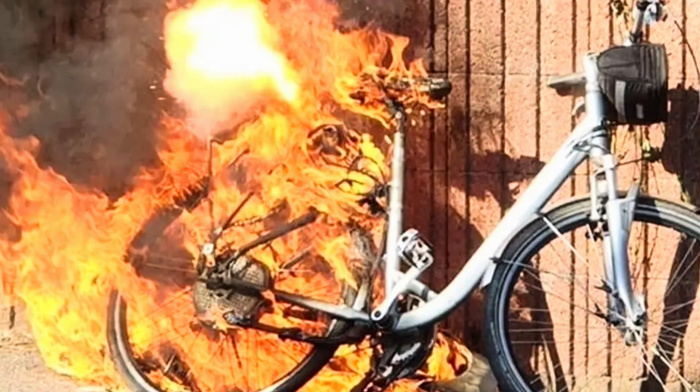Once you go into overcharging on a battery and leave it on overnight, if you haven't got a BMS, this is what starts the actual cascade of thermal runaway. You'll normally know if a battery's about to go off because you'll smell it first — there's a chemical gas that it gives off.